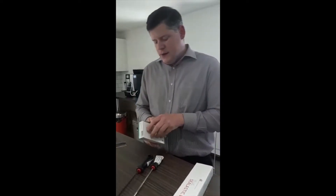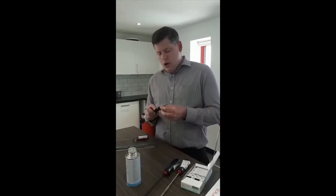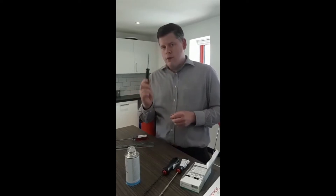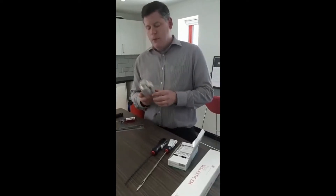Earth moving, as suggested, is for earth moving tires. Both ranges follow a simple concept: you have a hole in the tire, you enlarge and clean out the hole with a RASP. For small tires, you use the small RASP, then paint the hole with special cement.